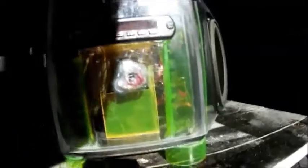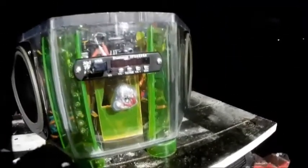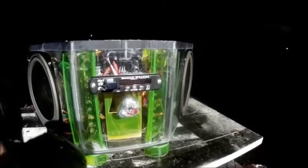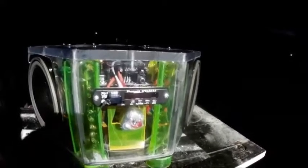Now there's the battery pack right there. That is probably what you would call a 3P3S, and what it is is 9 18650 batteries, 3 in parallel, and the 3 packs in series for 12.6 volts. The Sure Audio amplifier works from 20 to 35 volts if I'm not mistaken. It's only going to achieve 100 watts per channel at up to around 36 volts. Well, everything else in here runs off of 12 volts.